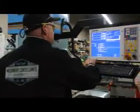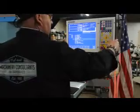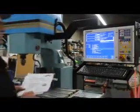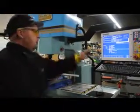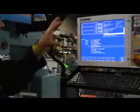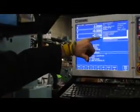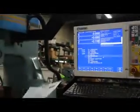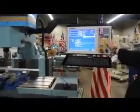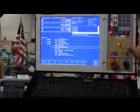We can run this machine in an automatic fashion, in an incremental or continuous mode, as a power feed situation — X, Y, and Z on the spindle. We're also going to treat this monitor right here — it's a 15-inch LCD monitor — as a digital readout for our positioning. You'll note that I'm coming in with 02468, 02468. So my resolution that I'm reading here is within two tenths, which is switchable, by the way. I'll show you how easy it is — that's times one, times ten, now here's times a hundred.